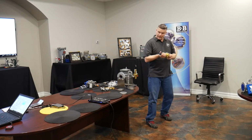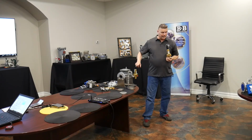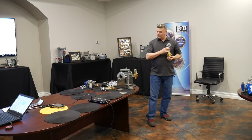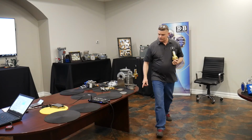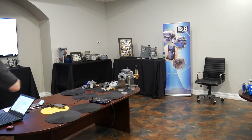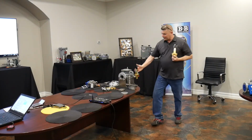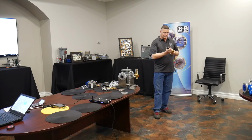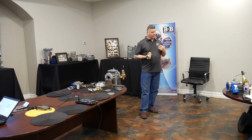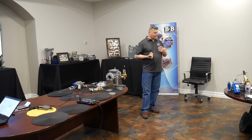Okay, so I'm using a brass Series 20 pilot for the conditions that we just talked about, where I might want to set the downstream pressure in our little example, 60. So that's going to determine the spring range in here. I'm going to pick a blue spring, which has a 25 to 90 psi range. I want to pick one that has the appropriate range. If I have two values, I don't want to be right at the edge of one spring. I'm going to use the one that gives me a little room to adjust.